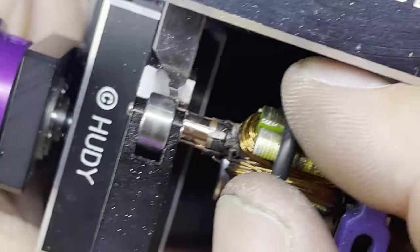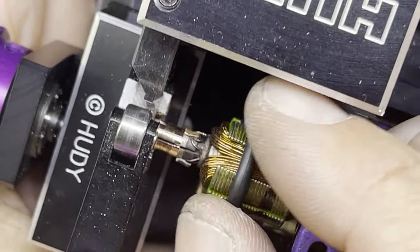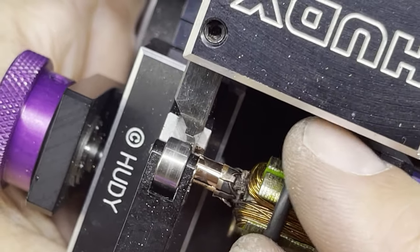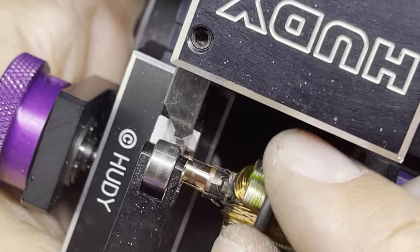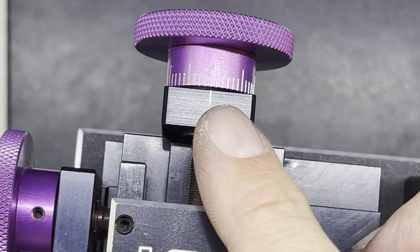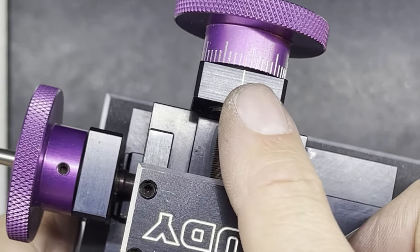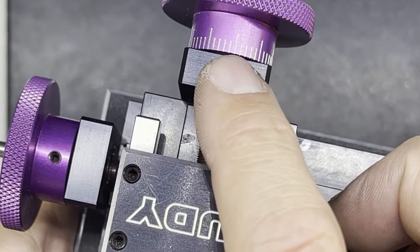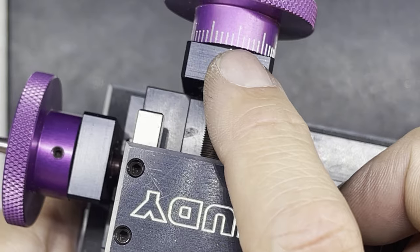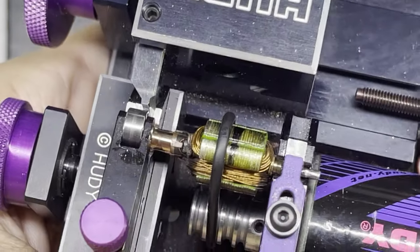This is a second pass over the commutator. You can see now that one of the segments is getting nearly cleaned up but the others clearly are quite a long way away. There are divisions on the comm lathe — when cleaning it up on the first cut I probably take one division at a time, but when you're getting close to the end you can take half a division at a time to remove very, very small amounts.